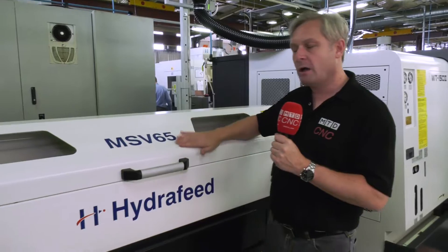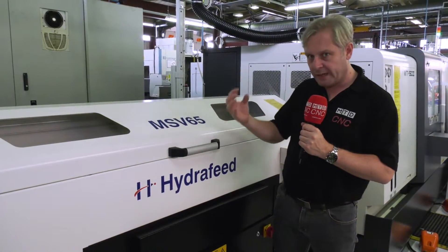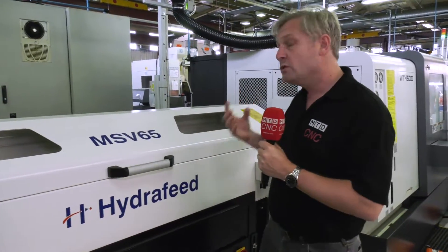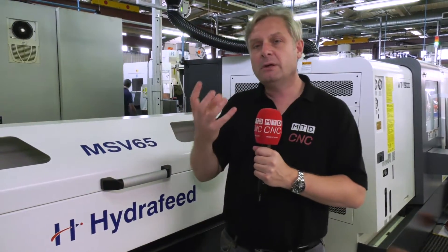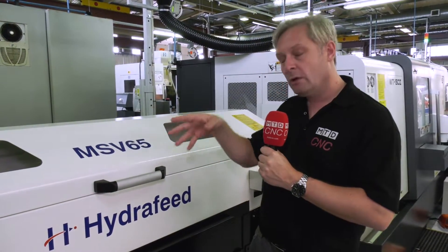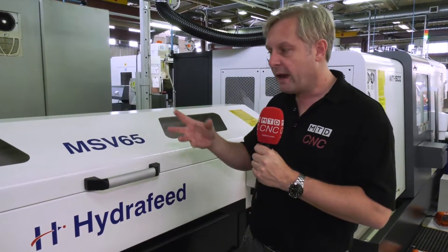Now you're loading your bar at the back. I can't open this at the moment because it's running, but it's got micro switches so that's controlling the bar being loaded for accuracy and obviously controlling it making sure there's no damage. It's not just bar either. A great example of how it works as a CNC: you could load in a shaft, for example, where you've already done operations on it. Load those in here, and because it's CNC, if the shaft's got thin walls, you push it in a certain amount, stop it, do your first op in the machine, and then it pushes through for the second op - and that's all controlled via the CNC. So you can really control that.